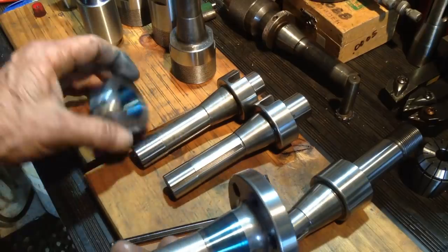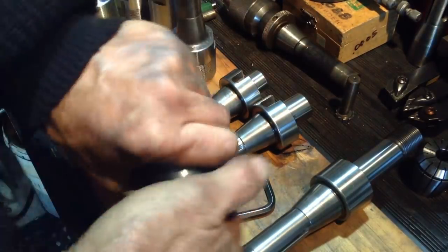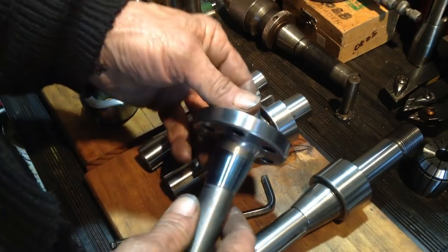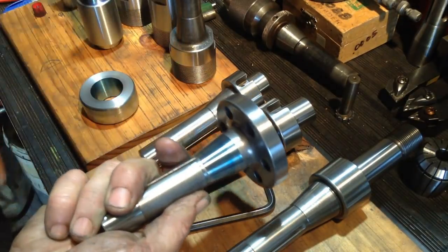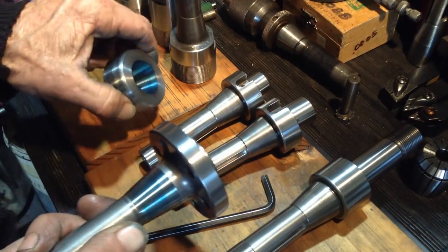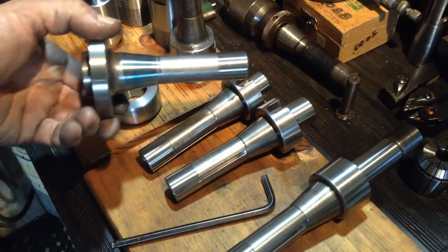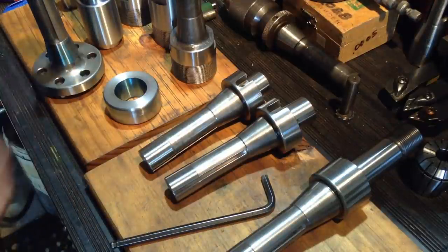And we're pretty even on our ring gauge as well. So that's looking good. Wipe that off. Do it again. The second time, you might not pick that on the camera. It's picking up that we've got it. We've absolutely nailed that spot on to our ring gauge. So that is exactly R8 specs. Now doing it a second time where I just wiped it off, that's the best indicator, as the thickness of bearing blue isn't masking any miscontact areas. So that is absolutely spot on. So we'll continue the rest. And like we mentioned before, when we have our finishing wheel on, we'll do the first one and we'll just double check this taper again.